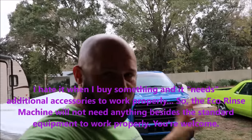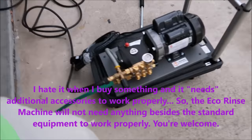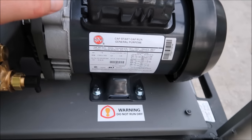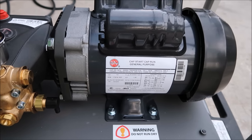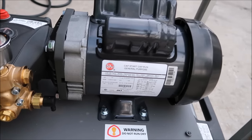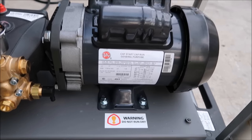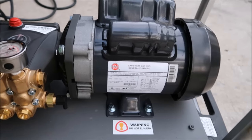The unit is going to be exactly the same. Originally we were going to use a one-third horsepower motor, but we ended up going with this half horsepower motor — it's just better. It only brings the amps up to about 6.3 versus the 5.1 I originally thought. The same generator that would power this at 5.1 amps will power it at 6.3 with no problem.